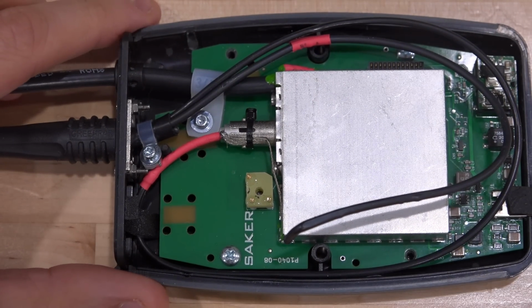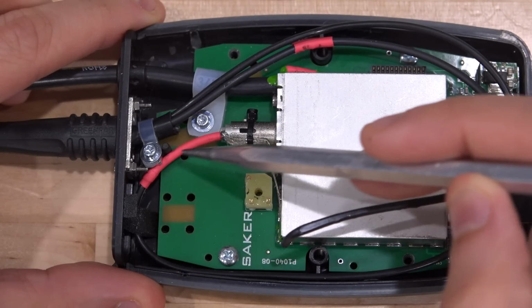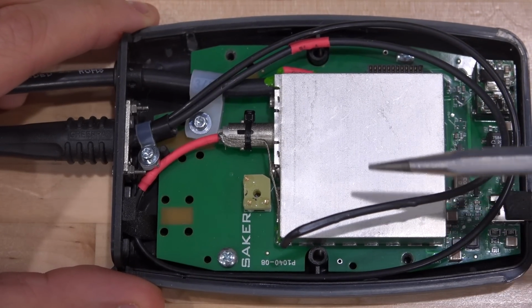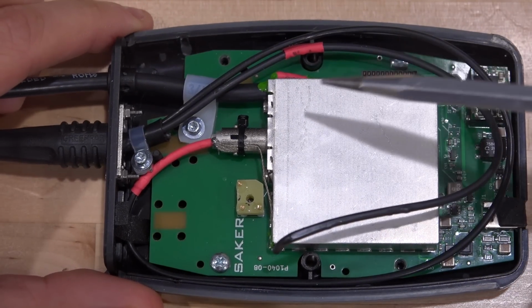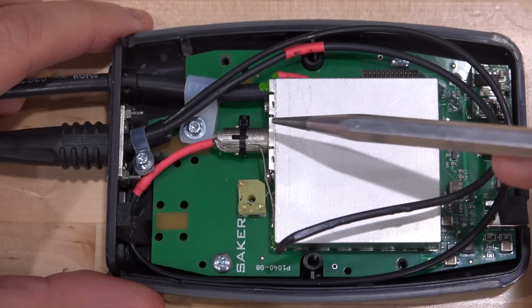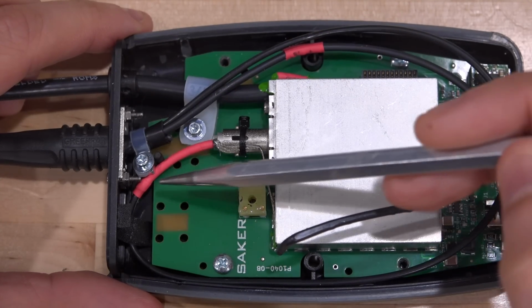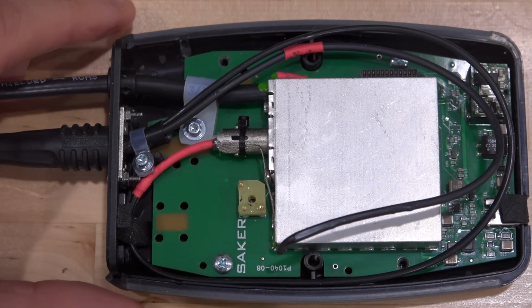Pretty nice and clever. We do also seem to have a lens that's custom made with the fiber coming in, focusing it into the photodetector. This also seems to be something that they may be polishing and making themselves. And this fiber is only one direction. The light coming over here carries the analog information up to 200 megahertz that you're interested in saving. So that just shines in there, and they need to convert that to electrical.